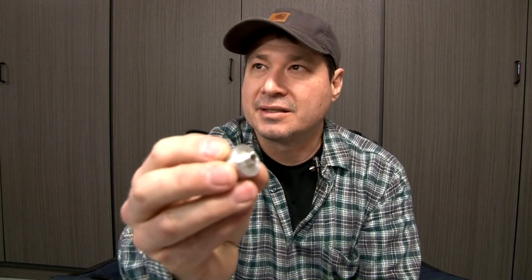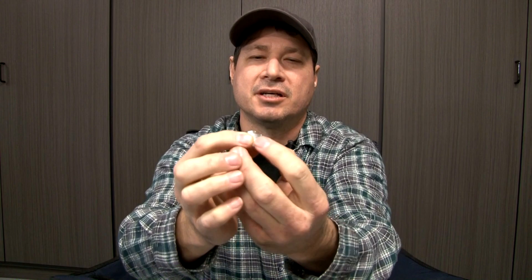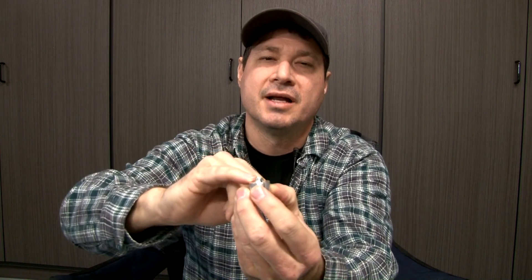To do that, I got on my lathe and cut out this little piece here. It's a piece of metal I cut out from bar stock. You can see it has a hole in the middle, the back side is cut out a little bit more, and there's a slit that goes all the way down through it — I used a bandsaw for that. The wire of the hot wire cutting tool will just go right up through the center, making it so I can tape the foam to a pattern, then move the pattern across the little nub and it will copy the pattern into the foam as it cuts.